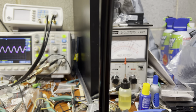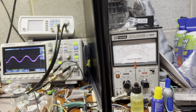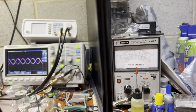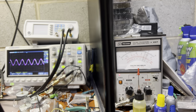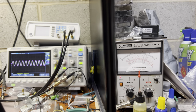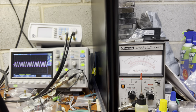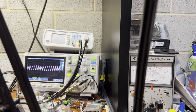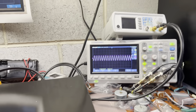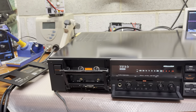At 4 kilohertz we're going down. Let's see how it goes up - now we're going up. It keeps well, three, four, five started to drop a little bit, eight, nine, ten. There is some drop but not critical - we will be able to adjust it using the trimmers, so nothing terrible. It keeps phase pretty well to 15 kilohertz, so I would say this deck has no big issues.